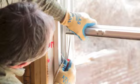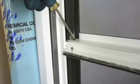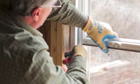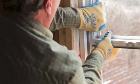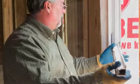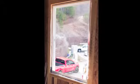Once this is done, you must depress the keeper rail anchor buttons located on the bottom and top of the meeting rail. Using a screwdriver, simply depress and rotate the keeper rail out of the anchor. Using a flat screwdriver, stiff putty knife, 5-in-1 tool, or wood chisel, gently pry the keeper rail away from the frame while pulling straight in toward you. Continue to pull the meeting rail in on this side, then repeat these steps to free the keeper rail on the other side. Remove the keeper rail and place it with the other stored items.